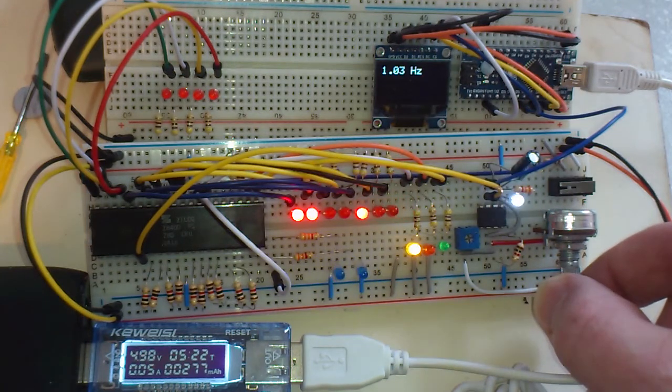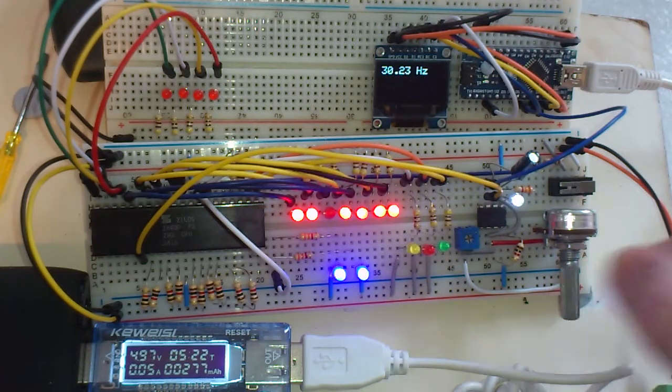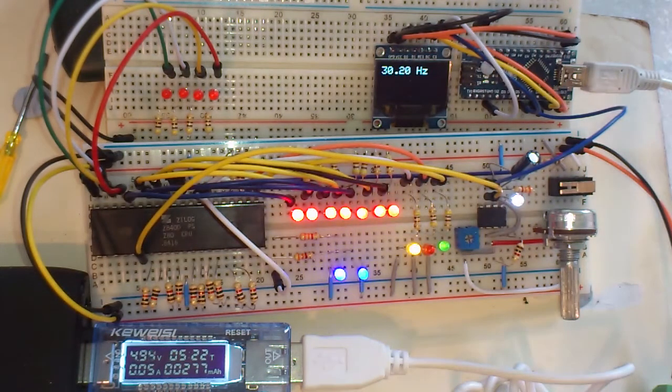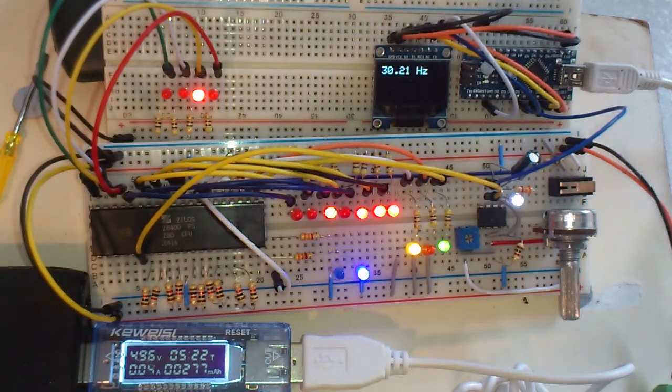So if you speed it up a little bit, let's go up to 10, 20, 30 hertz, yeah. Now it's a bit more funky for some people. I mean, look at that. Address bus updating. Ooh, it's really cool. And then when it gets to 127, it rolls over, and just waiting for that to happen is kind of hypnotic. And here we go. It's getting there. It's nearly 112. Rolled over, and that one incremented.